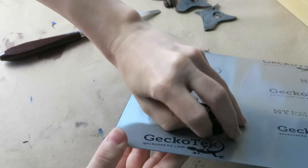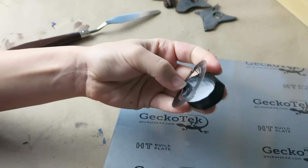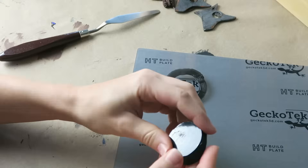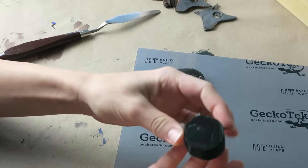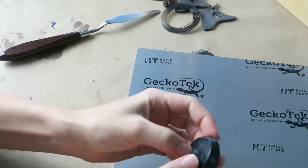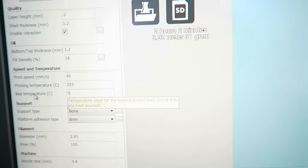Got a corner up. So it's not permanently bonded, it's just not as easy to take off. I think we need to do another test on that because the brim made it harder to get off — it wouldn't pop off. I don't think I needed the bed as hot as it was, but overall let's call that pretty successful with regards to bonding. This is a nice surface, but it may have pulled off a tiny bit. Definitely over-adhesion is more of a concern than under-adhesion with polycarbonate. I'll change this down to 50.